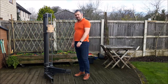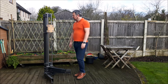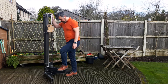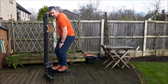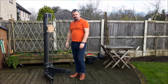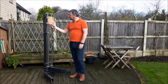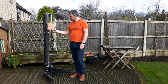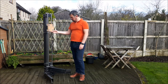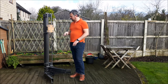A fair bit of drilling, tapping, bolting, and drilling out taps — it's wearing a bit I must admit. So what we've got here is this platter mounting bracket, which is fairly sturdy — it is 10mm steel plate and 3mm box section. Then you've got the Z axis, which is moving but making a bit of noise. That's because the rails and everything are just temporarily in; I haven't carefully aligned it all. It's basically just a trial fit to make sure things come together and that it's somewhere in the ballpark.